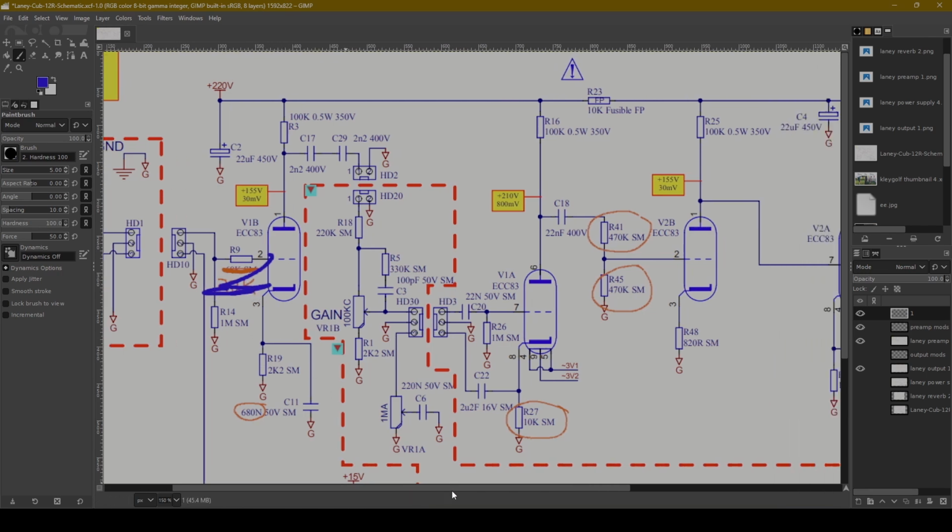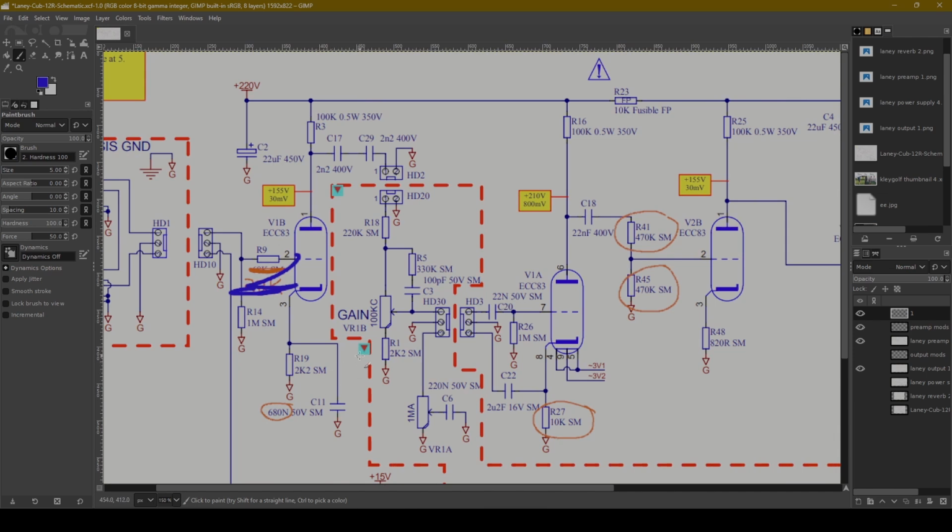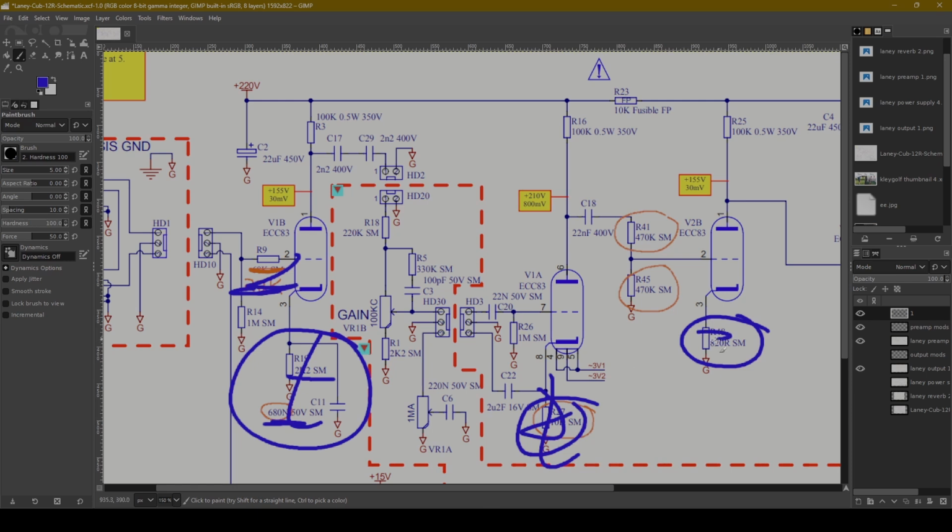The main things that I would be looking at are these components that I've highlighted in orange. So specifically, this first gain stage, the value of this cap, if you want it to be full frequency, you could do 25 µF, change this to 1.5K to get a quote-unquote full frequency boost. Changing this 10K cathode, this is our cold clipping resistor, and then also this 820 ohms. One thing I would be very curious about would be to see all three of these be a 1.5K with a full bypass cap, 25 microfarads. I would be curious about what that would sound like.